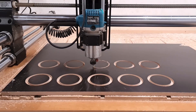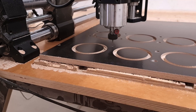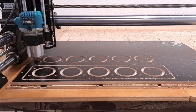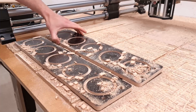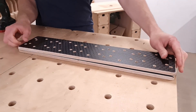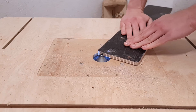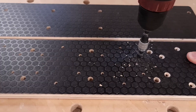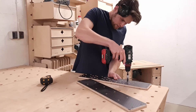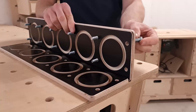The idea is to make the mold out of two plywood components with engraved circular pockets. When the parts are joined together the cutouts would form the shape of the rubber wheel. To be able to inject the sealants into the mold, one of the parts has six holes at the bottom of the pockets. Before proceeding with the injections I quickly chamfer the edges of the mold components and countersink the injection holes. The chamfered edges should make it easier to take apart the mold after the sealants have cured. I use M8 screws to secure the mold components together.